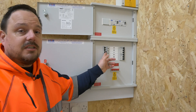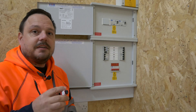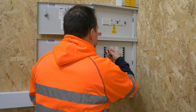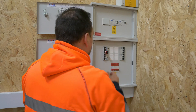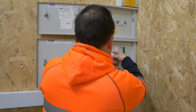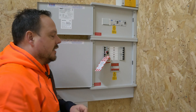I'm going to apply a lock to this RCBO here now and show you how you would do that in a safe way. I'm using the TIS safe isolation kit that we've got here in the booths down at Apprentice 1-to-1 Academy. If I pop in this lock-off toggle — I should have put my glasses on first because I can't actually see very well close up — but I managed to get it in there. We've got our padlock as well and our warning label, so if we pop that all into position and apply the padlock and remove the key.